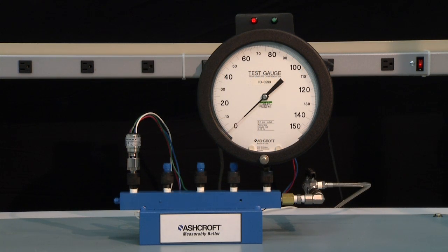We're going to set at 80 PSI increasing. We will take the pressure up to 80 PSI and then adjust the switch so that it operates there. This switch turns on before 80, so we are going to increase its set point until it turns off and then turn it back on again at 80.